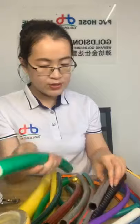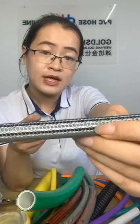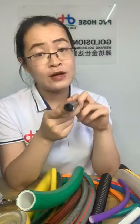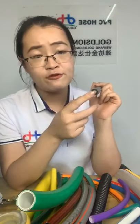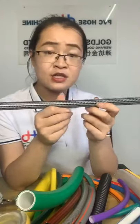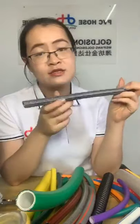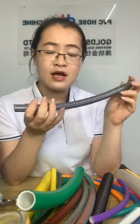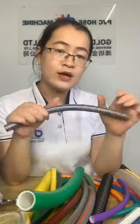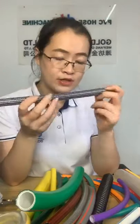And some customers may choose like this one, this is a crocheting garden hose. This one is special because it's five layer, multi-layer. The inner is PVC and the first braid is normal braid. Then the second PVC layer. Then the next comes the crocheting braid. Then the outer layer. This will help the hose get higher work pressure, and no kink when used. And you can make the inner food grade for drink water. This would be the most advantage.